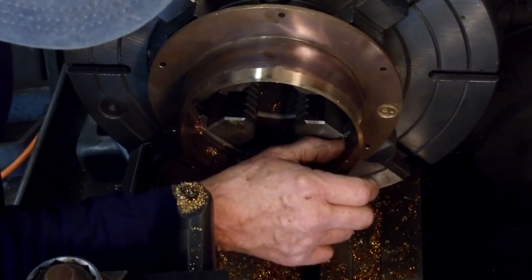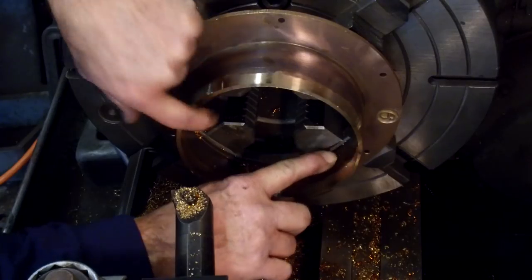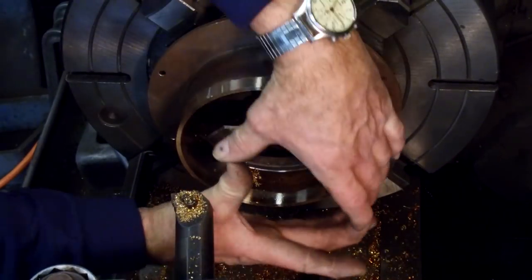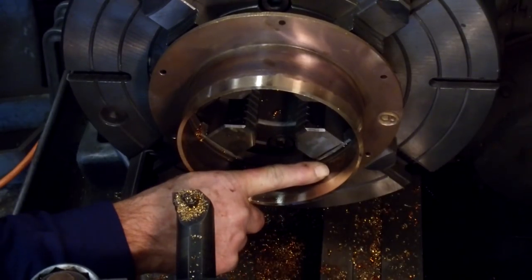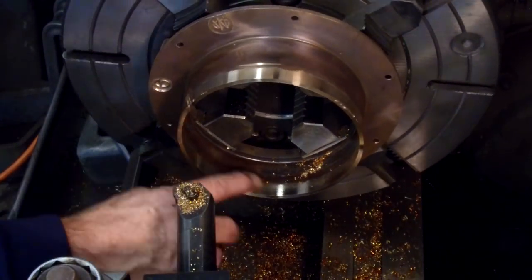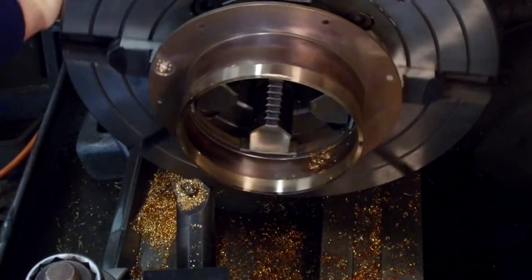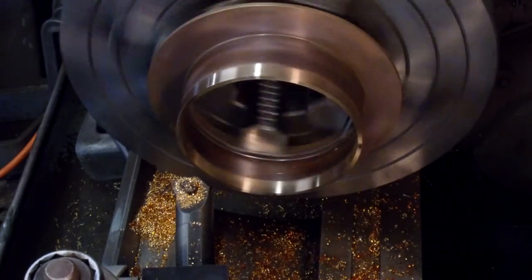But this weld just brought this in. So as it fades in here, this is probably larger diameter down at the root here than it is out here, because this has pulled it in. So it shrinks the tube as well. I mean, this is not the original diameter in here because this has pulled it in somewhat. All right, we're going to go ahead and take it down to 10 now. 10 from that scrape.